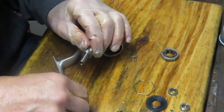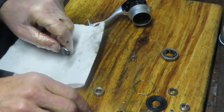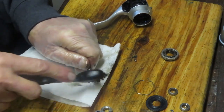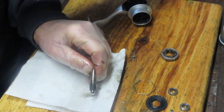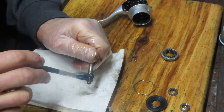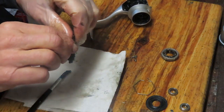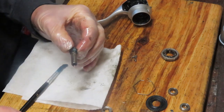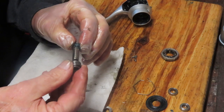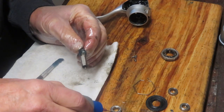There's a collar stack with some tension washers. Here's your bearing. I'm just going to pull out what little grease is there. This appears to be a stainless steel pinion — it's in very nice condition. I'm going to load that pinion gear up with fishing reel grease. I use Penn Precision Reel Grease and recommend that you use fishing reel grease. I also use an artist brush to apply it — that tends to not shed the hairs.